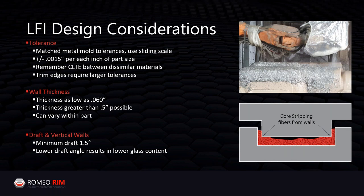When designing for LFI, it is a match-metal mold process, so you get match-metal mold tolerances. As a fiberglass-filled material, shrinkage is much less than unfilled plastic resins. This is especially important when bonding dissimilar materials — the glass-filled system will shrink less than an unfilled material, so a good adhesive must be selected and those shrink values need to be carefully considered when joining parts.